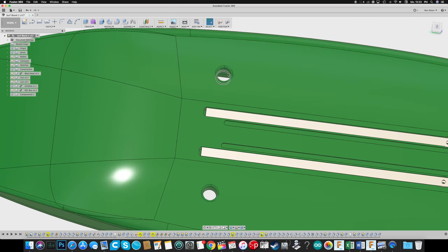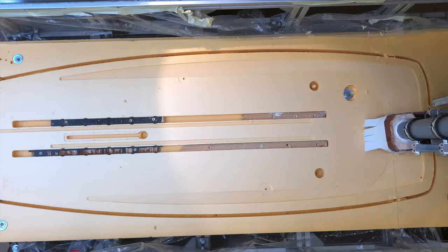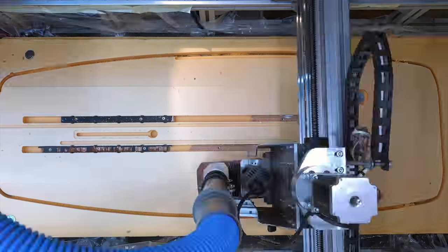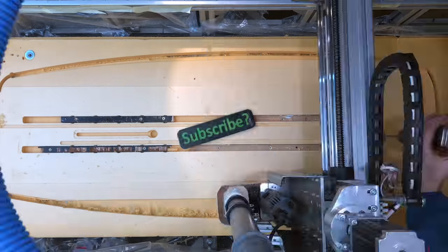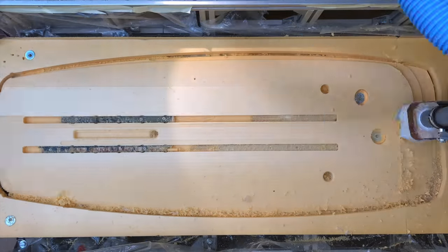I had to cut the bottom in three layers because my CNC just doesn't reach that deep. The board is 140mm high, so the drill bit has to stick out a little bit more than that — about 145mm. That means the Z-stage would have to be roughly 30cm long, and that's just too much for my CNC.